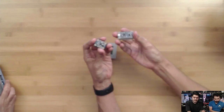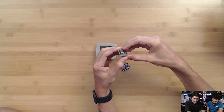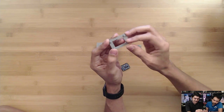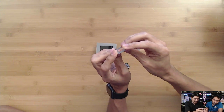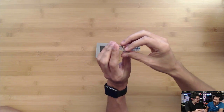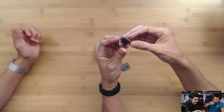Every time we make a project, we want to prototype the standoffs and things. So I've been experimenting with not using screws now, but using pegs. Pegs are just these little cylinders that pop out of the standoffs. And typically, I wasn't able to do this. When I first tried doing this with the Replicator and using MakerWare, I could never get this to work. Tiny little things never work, even if you had extra models to sort of have it go and cool down. MakerWare just couldn't do it.